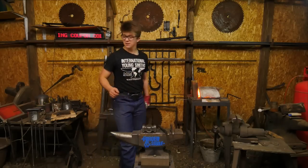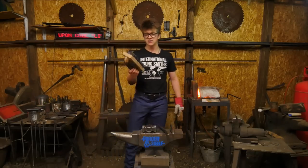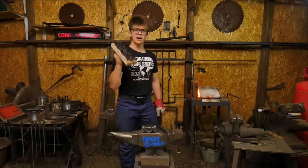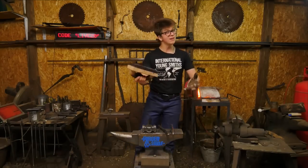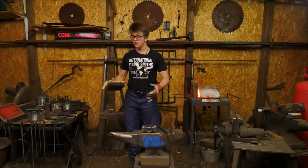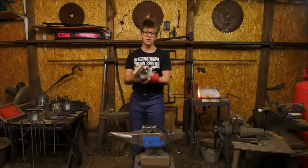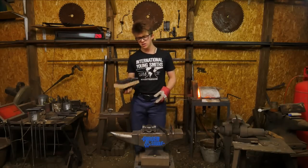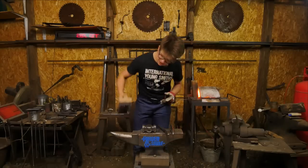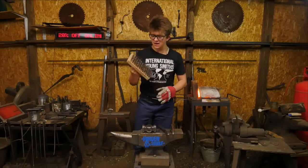Where do you get your block brushes from? I get the block brushes from farrier supply houses. I recommend no less of a brush than a farrier's block brush. Butcher's block brush, I believe they're also called. They're very aggressive. They'll cut you to shreds when they're brand new. I get about a year out of them, and I use them hard, doing those hammers. I'll often dig in with that backside.